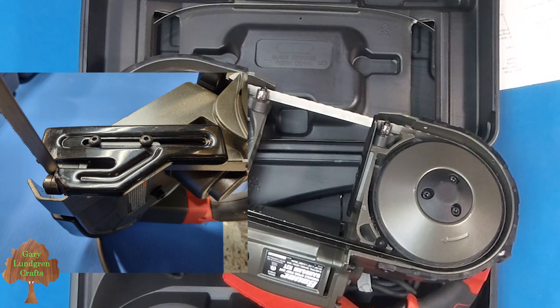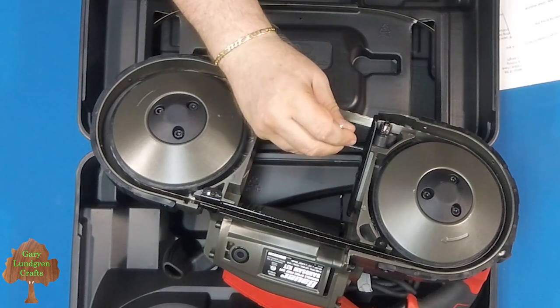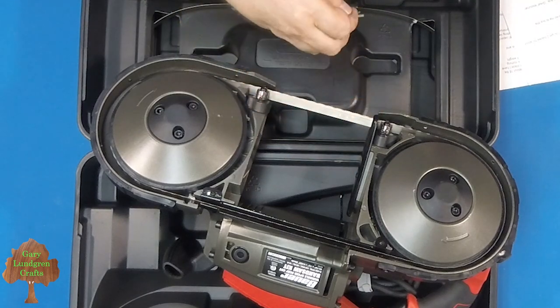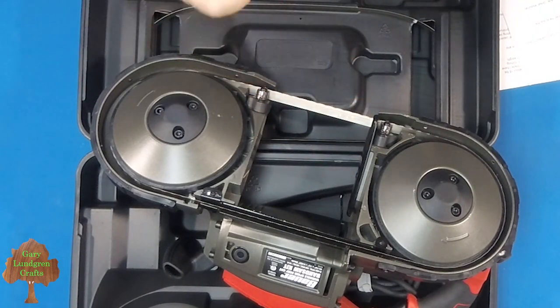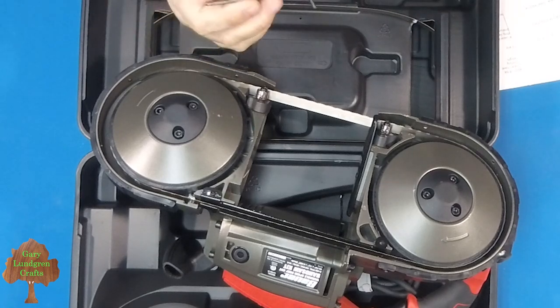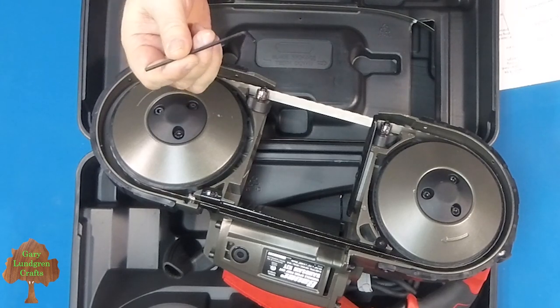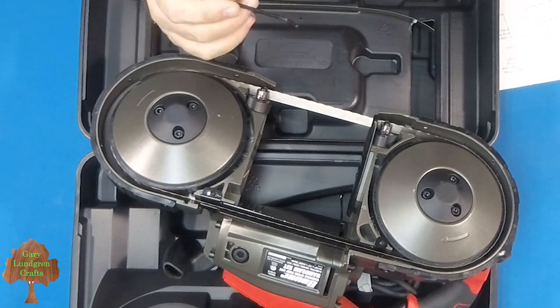What they give you with this in the instructions is an Allen wrench, which appears to be made of a soft metal. When you try to tighten the screws to adjust the blade in and out, this wrench tends to round over — and it's slightly undersized at just under 1/8 inch. I used a proper 1/8 inch Allen wrench from my set instead, which is much harder metal, doesn't slip at all, and makes it a lot easier.